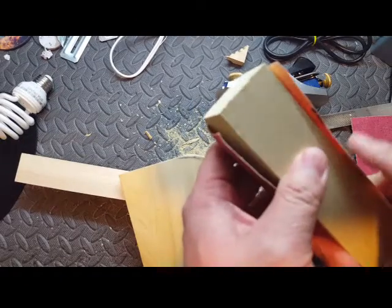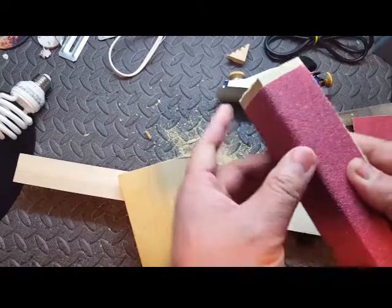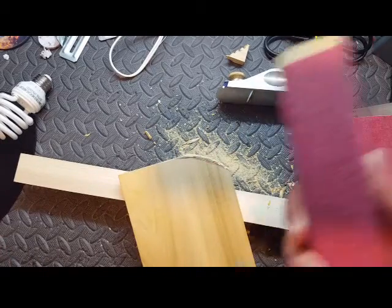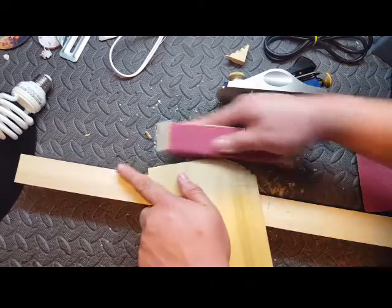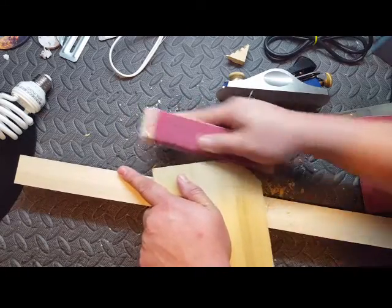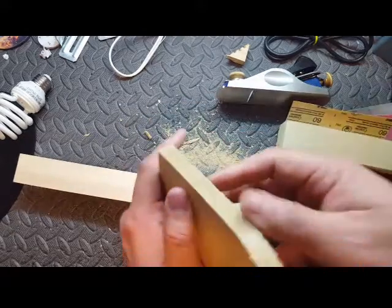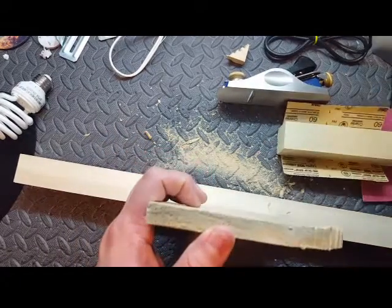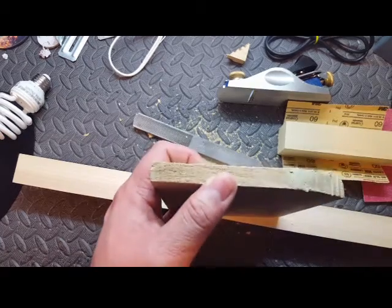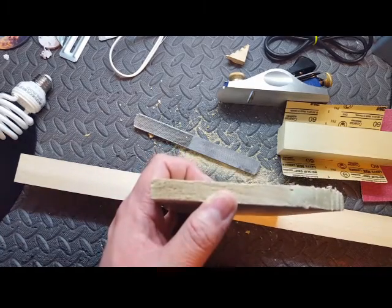What I like to do as well is use some spray adhesive — spray this side, spray that side — and then cut the edges so they're perfectly flat and you don't get any curves on the sides. Take your sandpaper — this is 60 grit — and just smooth out that edge. That'll slowly start getting rid of the deep gouges that the file left, and then you just keep going higher and higher with the grits until that edge is where you want it. I think you get up to 320, it should be okay, to start filling stuff out with a grain filler or whatever you want to do as you finish.